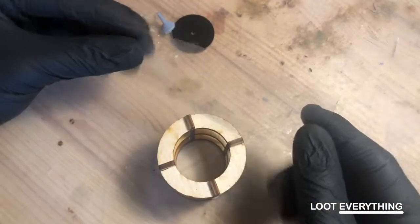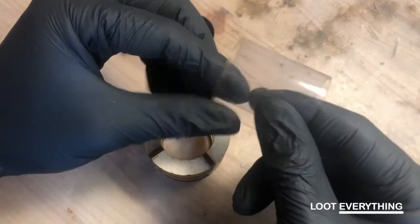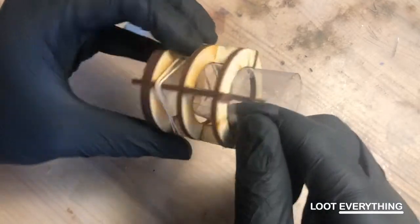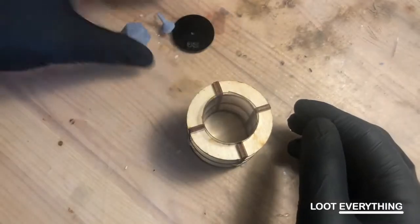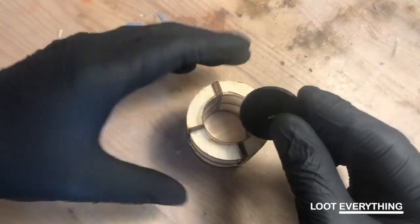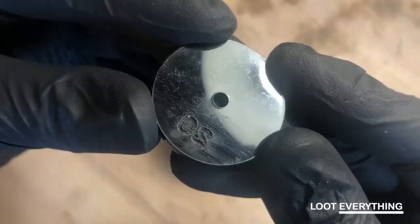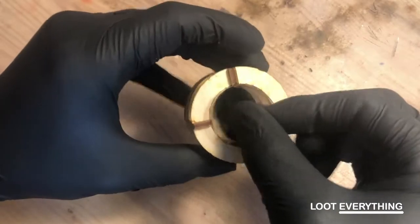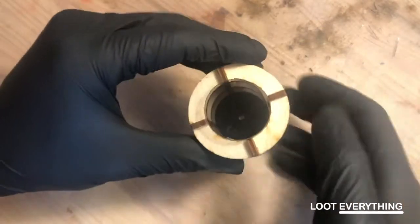Inside the wood rings, I put a piece of clear acetate that's been laser cut to fit the height of the rig and long enough to cover the entire diameter of the mold plus about a half inch of overlap. Then I insert an acrylic plate at the bottom that'll hold the sprue in the center. This plate is laser cut slightly smaller than the diameter of the mold, so it holds the acetate wall in place and creates a seal so the silicone won't slip out.